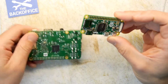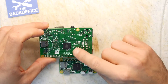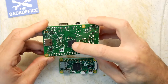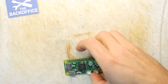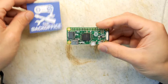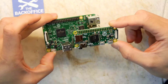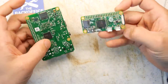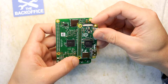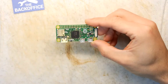And there's your SD card slot — very similar to the one you get on the back of the 3B; it's pretty much the same part number. I've also noticed on the back of the other Pi there's something else. Because you've got on here a sort of Bluetooth and Wi-Fi chipset somewhere — I'm guessing that could be it. I always thought that the Broadcom chip here was the main processor, but if you look on the back, they both share this same ELPIDA chip. So perhaps that's actually the ARM processor, meaning the Broadcom thing must be just handling all sorts of the IO. If you do know the answer to that, please let me know down below.